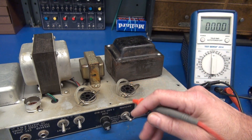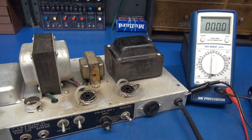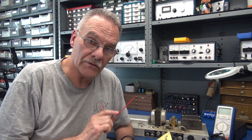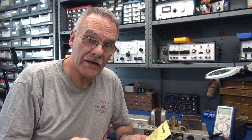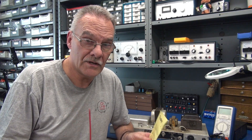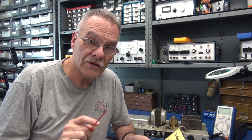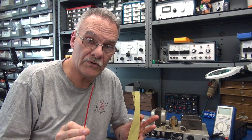So if you were to pull your output tubes and go in there to tweak, you might lose your fingernails — or worse. We've isolated the problem to the worn tube sockets, which affects the bias and after a short period of time will fry your output tubes. Here's some words of advice: if it's worn, replace it. Do not reform it.